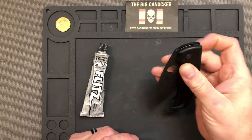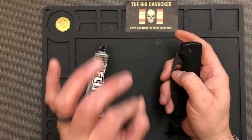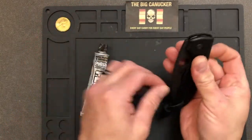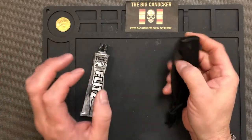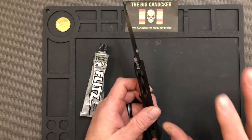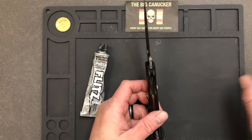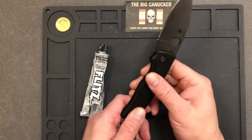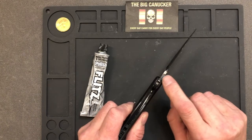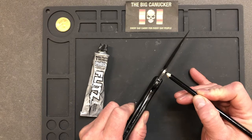It was kind of dropped shut before, but it almost had a tiny bit of a grit to it. Now it is so smooth — it's incredible. The flip factor on this knife has gone through the roof once I removed those nubs. Not only did I polish up the detent ball and the pivot path, but once I put the knife together I found I still wasn't finished, so I took my Dremel and gave it a little bit more work, and I almost lost the first little bit of the jimping there too.